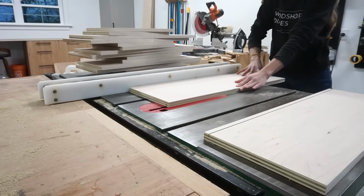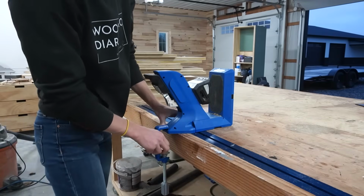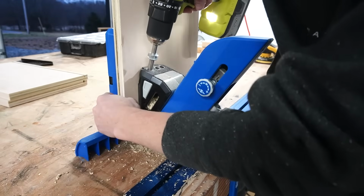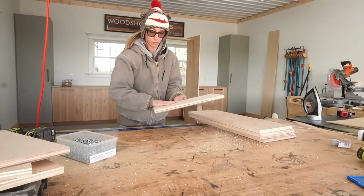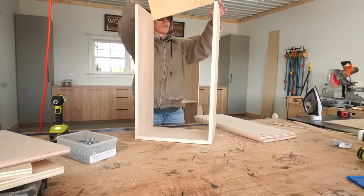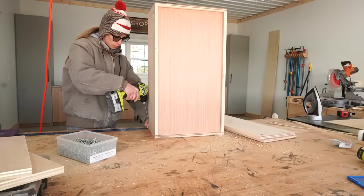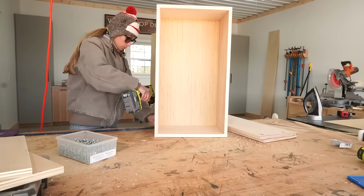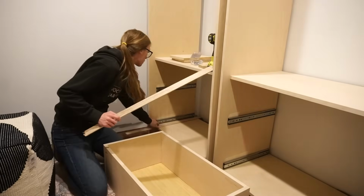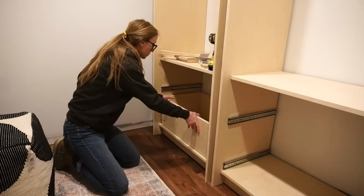To build the drawers, I used my leftover 10-inch wide plywood strips to cut down the pieces to make 2 drawer boxes for each cabinet. If you've seen many of my videos, you probably know the drill by now, but I cut these pieces to length, then cut dadoes to install the 1/4 inch drawer bottoms. I assembled the boxes using pocket holes and screws. Edge banding on drawers is totally optional, but I do think it looks a lot nicer, so I did edge band the top of these pieces before putting them together. Then I installed the drawer boxes into the cabinets. I have an entire tutorial that I'll link below that walks you step by step how to measure, build, and install drawers and drawer slides.